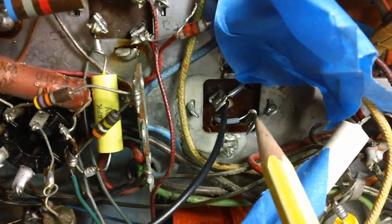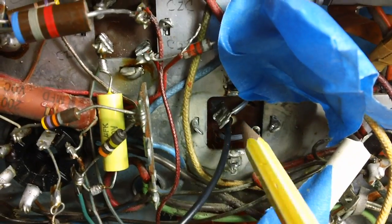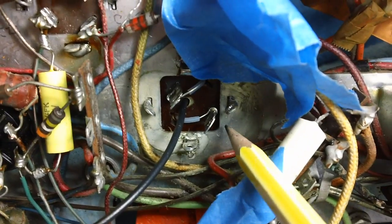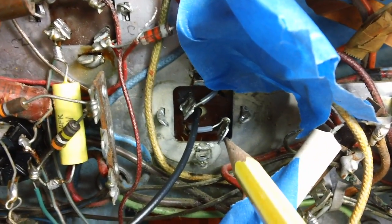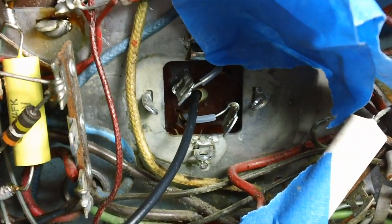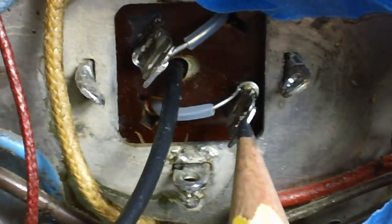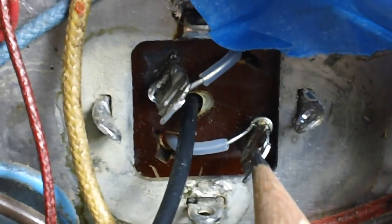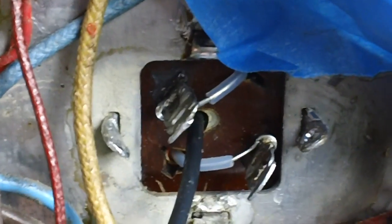I just reinstalled the can - I haven't hooked up any wires yet. I twisted these little tabs and it's held in nice and tight. But I have a problem I'm concerned about - that wire right there is too close to the chassis. There's a lot of voltage in these cans and I don't need any arcing. Some people would just bend it in toward the center, but no - that's not the way to do it. What we're going to have to do is desolder that wire and move it up further on the tab so it's away from the chassis.